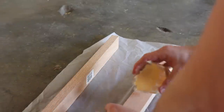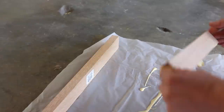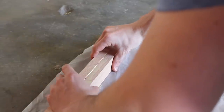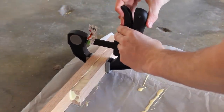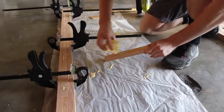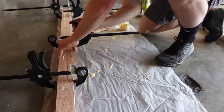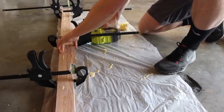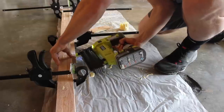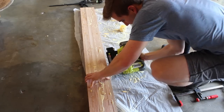After removing the tape, it was time for the final glue up. This was really a one slat at a time kind of process where I applied a ton of glue to each piece and then clamped it into place. I was very careful about keeping everything as flat as possible. For each new glue up, I would clamp my slat into place and then use finish nails to hold it together to avoid any slipping. Piece by piece this thing slowly came together and I could feel it getting really strong.